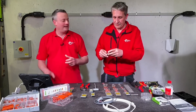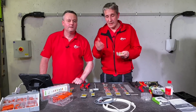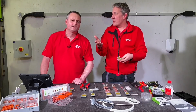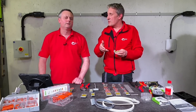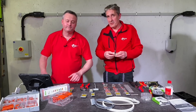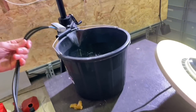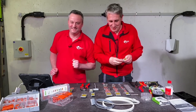When we think about using these in applications, low voltage or safety extra low voltage lighting systems are ideal. I've got an example here with an LED strip at 24 volts connected through the box. If you're going to use them in a mains application — such as bollard lights where you might get condensation — you would have to be inside some other form of electrical enclosure. Other approaches like poured-in two-part gel can be expensive and take time to cure. This is super quick — stay tuned to the end where we'll drop it live into a bucket of water.